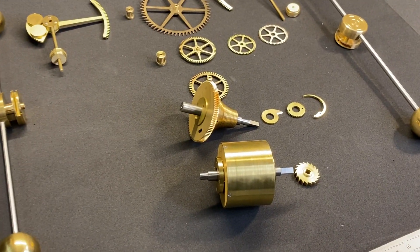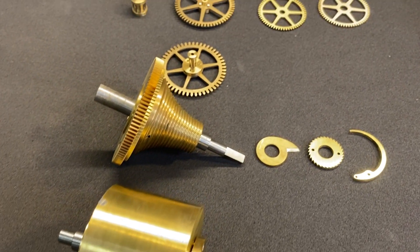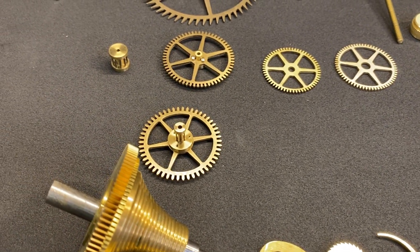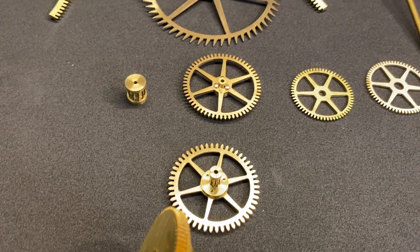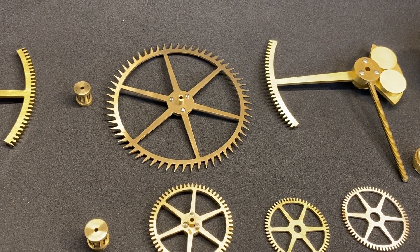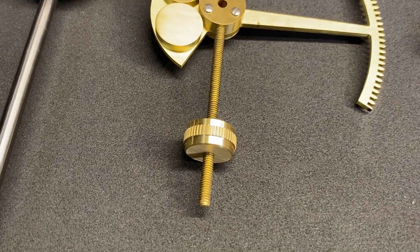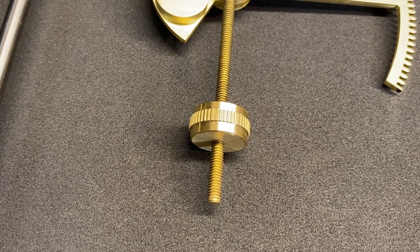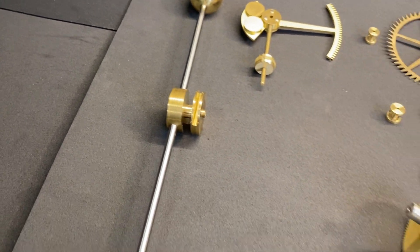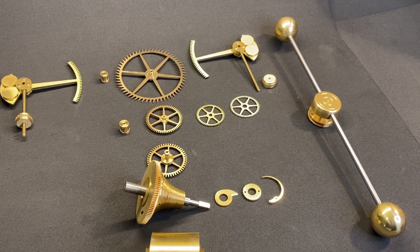So now let's take a look at what I've done so far. I've got the mainspring done. I've got the fusee — it's got a maintaining ratchet, the great wheel. Then you can see walking up: the center wheel and its pinion is done, the third wheel and its pinion, and also the hour and the minute wheel. Up there you see the scape wheel and its pinion, and those are the forks to keep things in balance. And that's the part we just made — it came out very nice. None of these parts are finished yet; that's going to be a whole other operation. And there you see the pendulums. So I have made quite a bit of progress. I'll start on the frames and make sure all this motion work works.